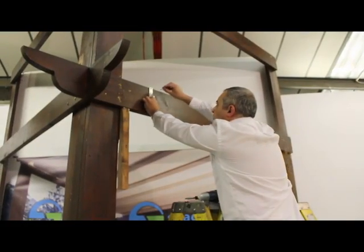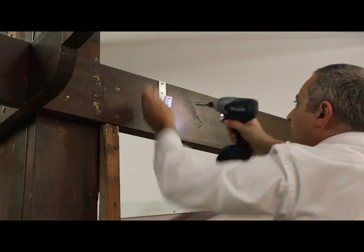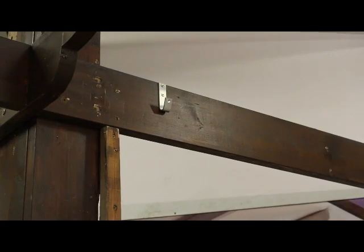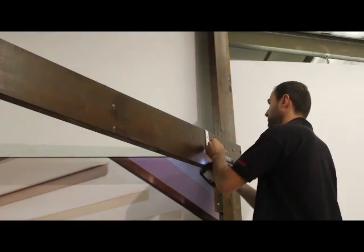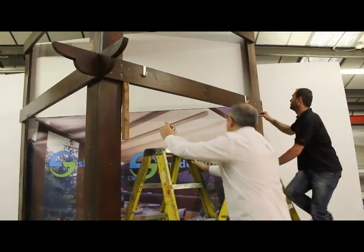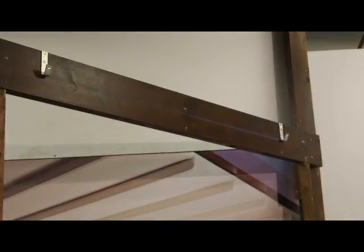Need to put the brackets with 2 screws. That's flush from top. Make sure that it is straight. Same we do the other side. And for more than 2 brackets, we need again to use the chalk line. So we mark inside the brackets, tension them, and mark up, so you've got a straight line, then you put the 3rd, 4th bracket as you need.